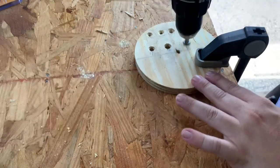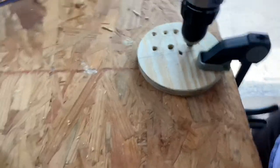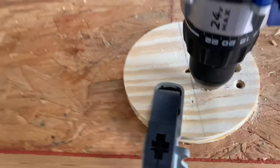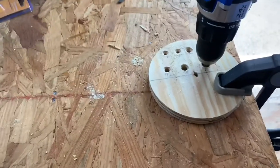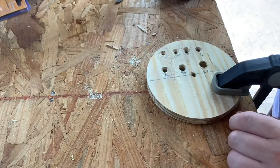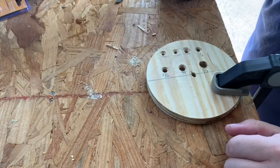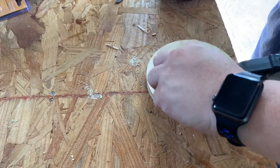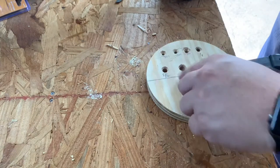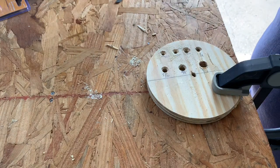Now the half — the half is not going to work; it fits right inside the half-inch hole, all the way. So the biggest I could get it to was a 3/8, and it's not really a beveled countersink — it's kind of a straight countersink, not really beveled down. I think if you're trying to get a beveled look, somewhere between 3/8 and 5/16 there is one, but all I've got is a 5/16 drill bit. I'm not really liking this.